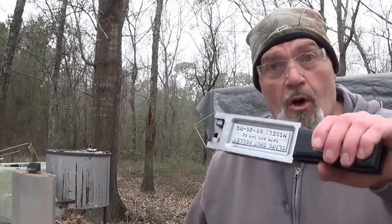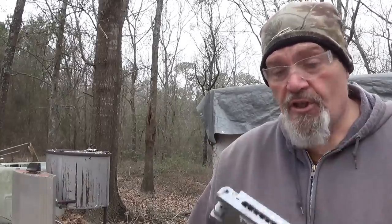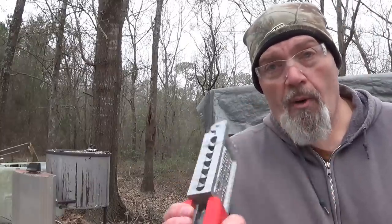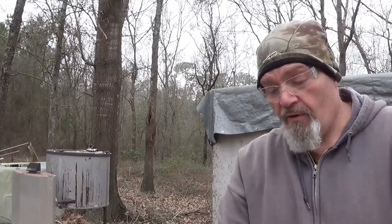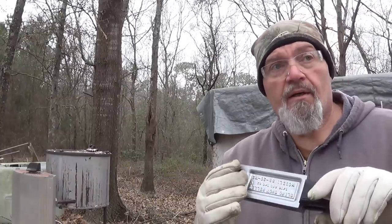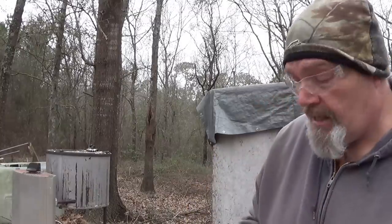Okay, these are ice cold molds. It's about 35, 36 degrees out here. The molds are gonna be 35, 36 degrees. They will pour better as you warm them up. The bigger ball molds heat up faster because you got a lot more hot lead going into that aluminum block, and they heat up really fast. The smaller one, however, can take you two or three pours before it really starts heating up and doing a pretty good job of pouring all pellets full at one time.